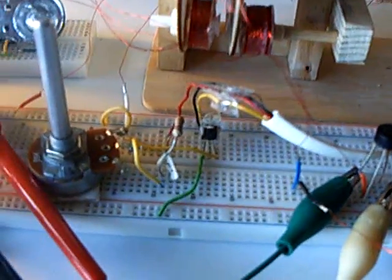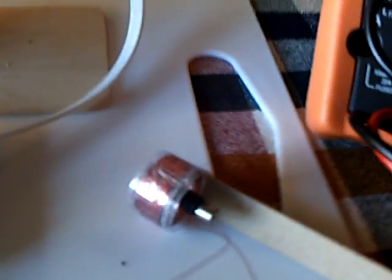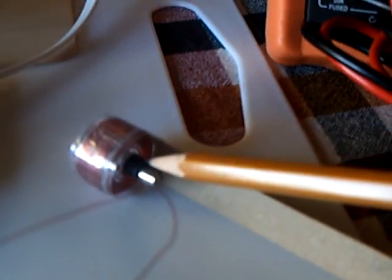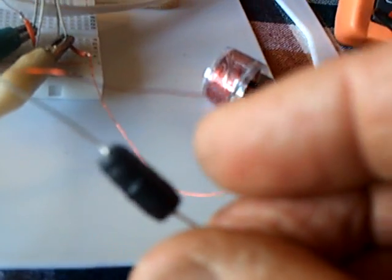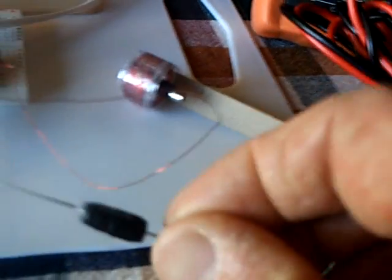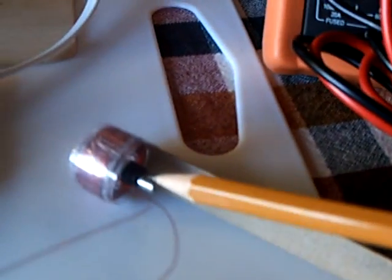That little Hall circuit works quite nicely. Today I worked exclusively on these power coils — these generator coils. I wanted to work with the ferrite core with the magnet biasing the coil. One of my viewers made the comment that I could take a ferrite choke and use that inside the coil as the ferrite core, and it worked quite nicely — real well, actually.